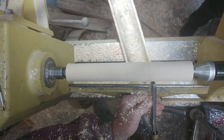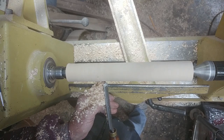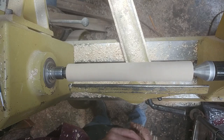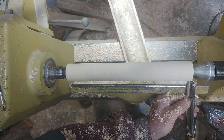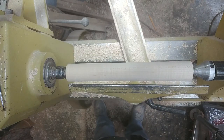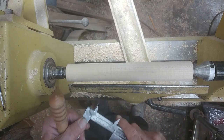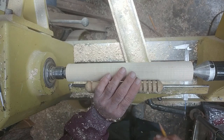Taking that wing, following it along, and just sliding across that piece of wood — all the way to the end. I've got this index finger riding on the tool rest as a gauge. I'm not pushing in, all I'm doing is sliding to my left and that gives me a good clean cut. Now the first thing I want to do is grab my pencil and my calipers and keep them right here handy.